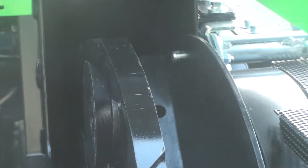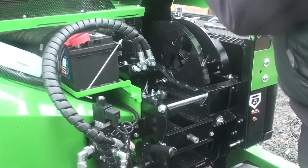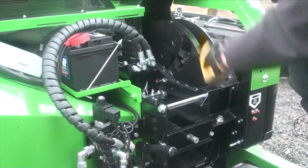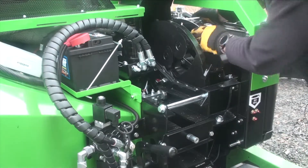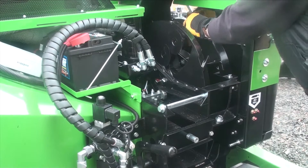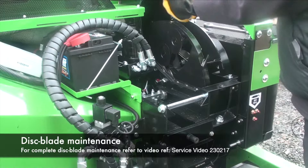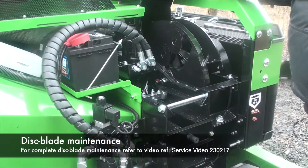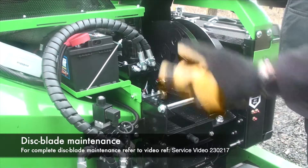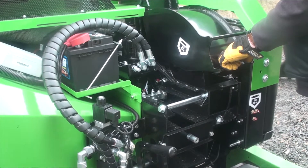You can use the locking bolt to lock the rotor in the right position when turning the blades. The flywheel could be dirty, covered in grease, or have muck in there, and it has sharp blades — so it's advisable to wear gloves. Hold back the locking pin, turn the rotor around to the right place, put the lock in, and it gives you access to the blades without fighting rotation of the flywheel when undoing or doing up the blade bolts.